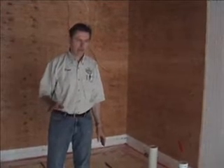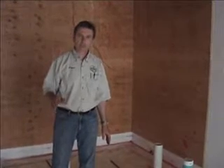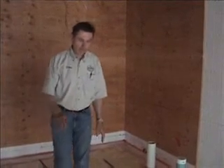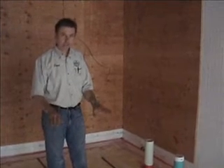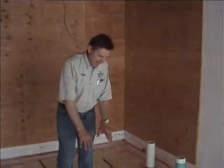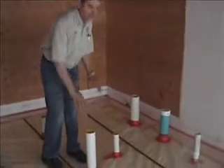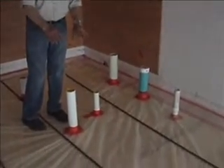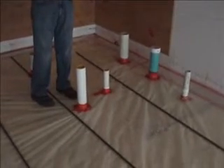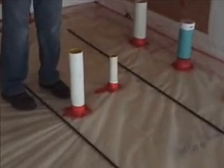What we're going to talk about in this video is the preparation under the slab. We've got 12 inches of XPS insulation — four layers of 3 inch. And each layer, as it's going through these plumbing pipes and stuff like that, is sealed individually. So each layer makes its own sealed barrier against the soil.